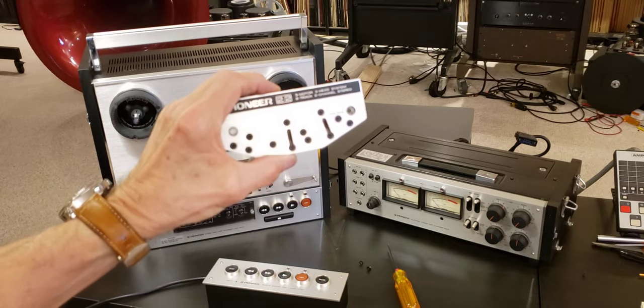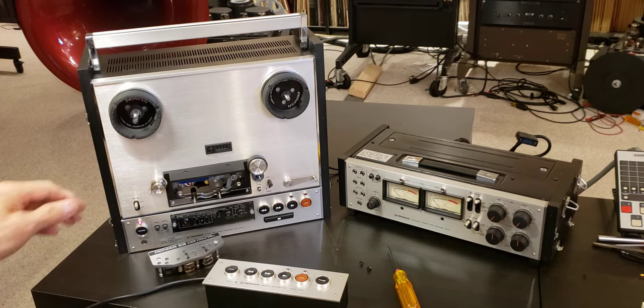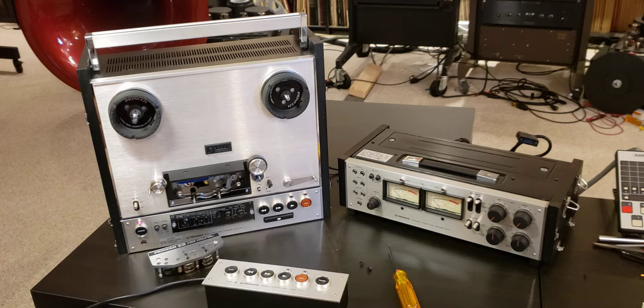Now, on this block, you see 2/2. And that indicates two-track system, two-channel, two-track. You have multiple choices here. You can go with a four-track head block, and then your machine might become four-track, two-channel. On the other hand, if you add another electronic module to this machine, it will become four-track, four-channel machine, which is sometimes used in recording, and it could be very, very nice feature to have.